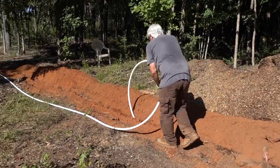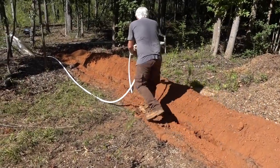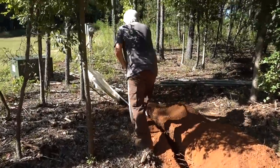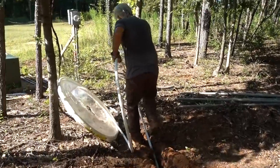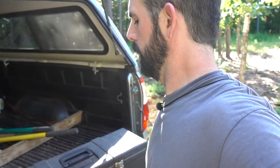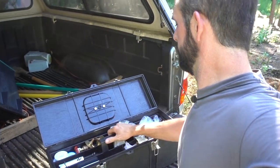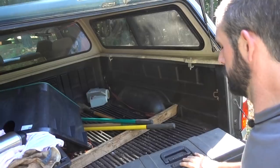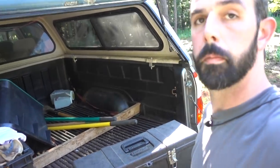His little roly-poly method there is amazing — that works so well. He's not knocking any dirt in the hole and he's literally just keeping forward pressure on the roll and rolling it into the hole. We need a cutter. Getting some PEX cutters or tubing cutters and a paper towel out of our handy-dandy plumbing box. Let's do this — that thing chews that right up.